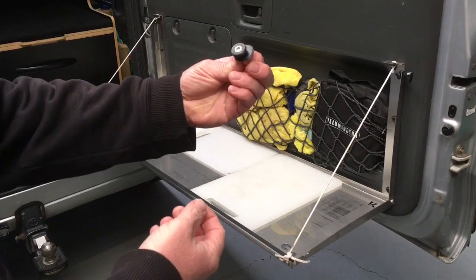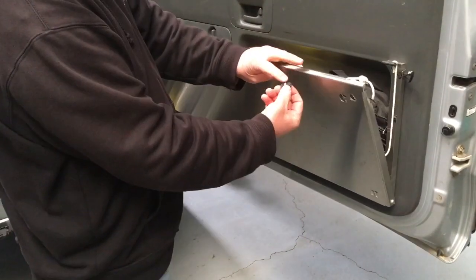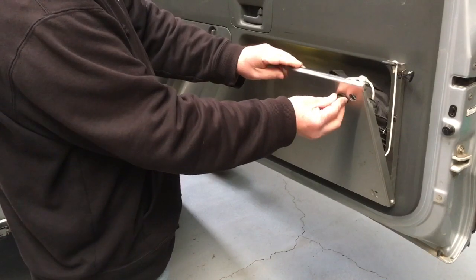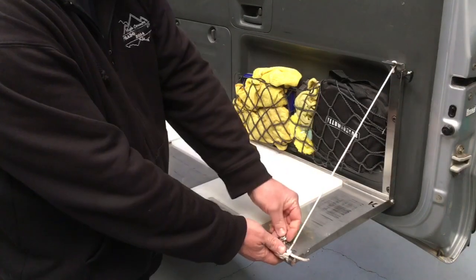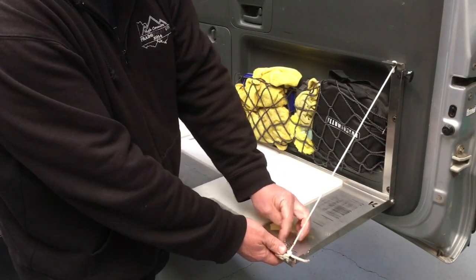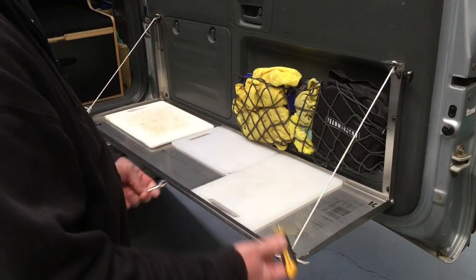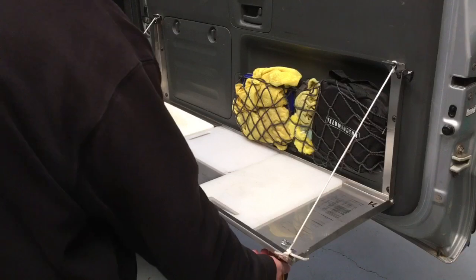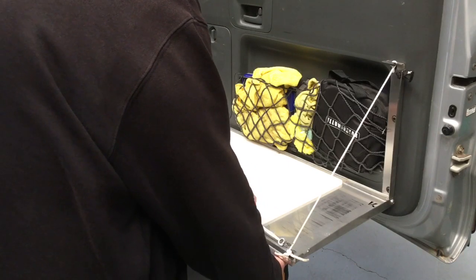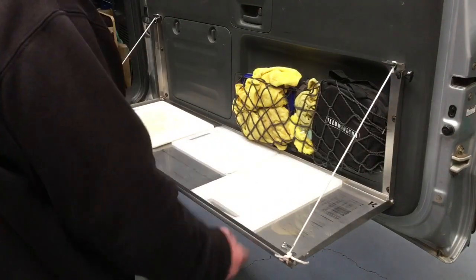So they're just these little — I don't know what you'd call them. They're a really cool design. They've got little feet on there that actually slots in and sits perfectly in place like that. And it comes with a bolt and a nut, and it's literally that simple. With these, they're a flange nut that's got a grippy on the back. So the ideal way is to put your Allen key — 5mm Allen key — there, and put your spanner over it.